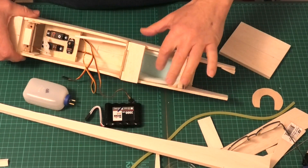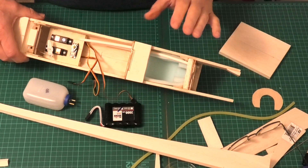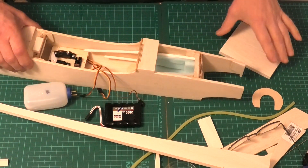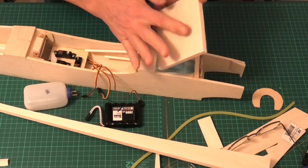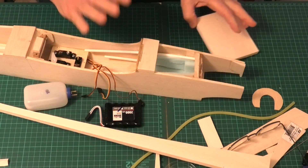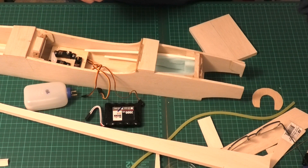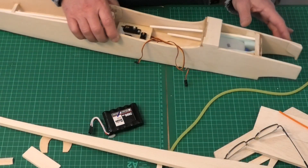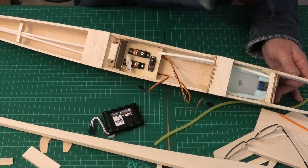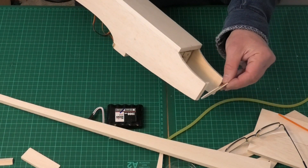I should mention I fuel-proofed the whole of this fuel tank bay prior to sticking the foam on, just to protect it in case of a fuel leak — also the back of this former and around here. When I come to do the sheeting I'm also going to fuel-proof the underside of the balsa so it's really well protected. To do that I use my 30-minute ZAP epoxy, thinned down a little bit with some ethanol. This is done now and I'm ready to move on — start doing the sheeting on the underside at the back, and also work on this nose section, getting it to profile with the nose ring and other bits of triangular stock.